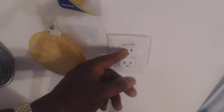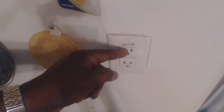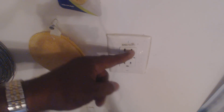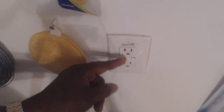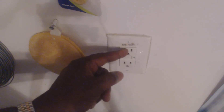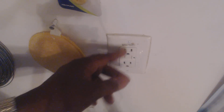This also works when you plug in, say for instance, a grinder. You've got your amperage coming through here and then coming back in to your common going to your transformer. Anytime you have a difference between your outgoing and incoming amperage — it could be as little as 5 milliamps — it's gonna kick this circuit, because it thinks a wire has shorted out to something and your amperage is going somewhere else. This is a protection against electric shock.